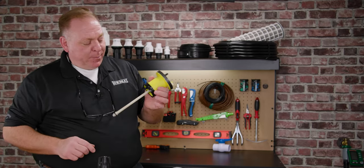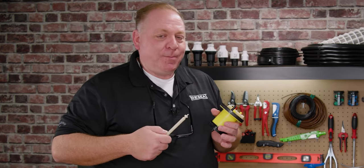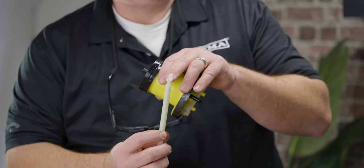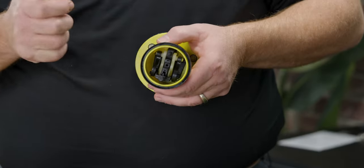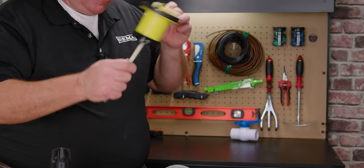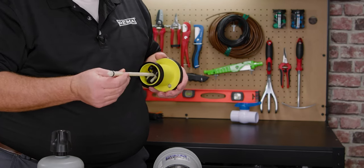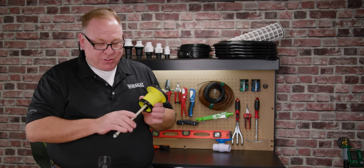The lower portion of the piston is the chemical pickup rod, with the o-ring at the bottom. Use a small screwdriver to pry off the old o-ring and slide the new one on — it's included in the kit. To remove the chemical pickup rod, it's only a quarter turn. Everyone knows the sound of breaking plastic — when you do that quarter turn, you'll automatically think you broke it, but you haven't; it's just how the plastic sounds. On reinstall, there's a barb on top of the rod and a hole inside the engine where it inserts. Line those up, quarter-turn to lock, and use your hands if possible to avoid any scratching or marring on the rod.